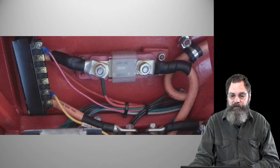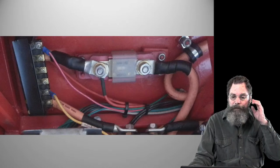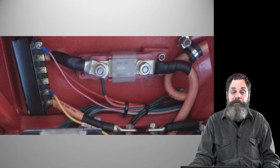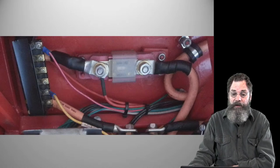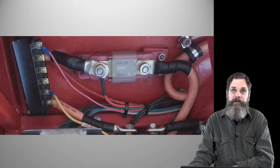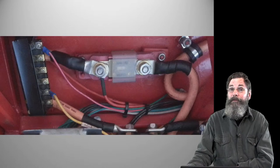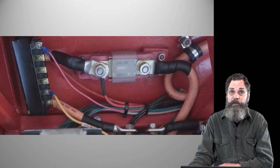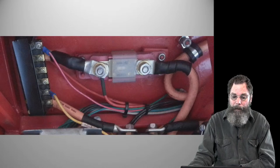There's our power fuse there, a close-up of it. Essentially, it's just mounted electrically on two studs, and then the whole thing's lifted off the chassis of the box a little bit, just to keep it off the surface. And also, if there's any water condensing down there, or something dripping, it's not going to get into the components. That's why you lift it off a little bit.